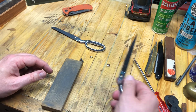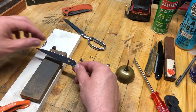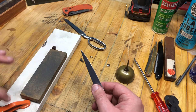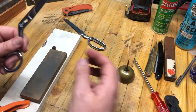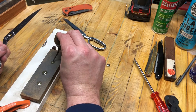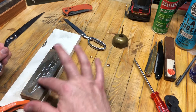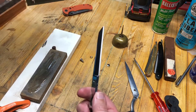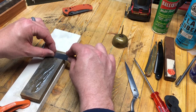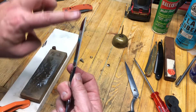Let's get set up here and sharpen these. I've got mine just sitting on a board so there's plenty of room for the handle to clear. It's clamped down — nothing much to the setup. We're going to place some honing oil on the stone. We've got a nice bevel to follow, we're going to place that on the stone and draw this down, keeping that angle all the way across.